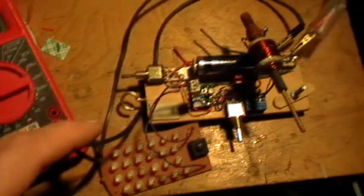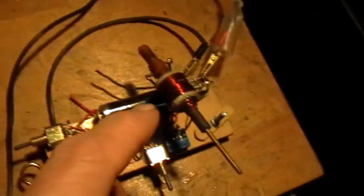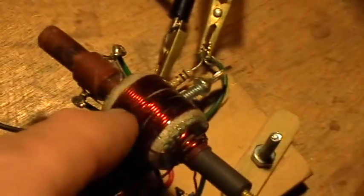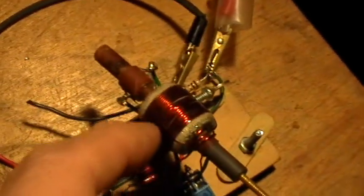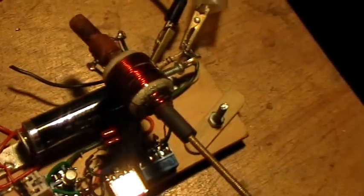For the coil I have this loop stick variable inductor that I've modified by putting a layer of cloth tape over the standard loop stick windings, which terminate here and here, and wrapping some number 22 magnet wire — I think there's about 20 turns — around the outside, then sealing it with epoxy. That becomes the primary coil, and the loop stick's regular coils terminating here and here are the secondary coil.